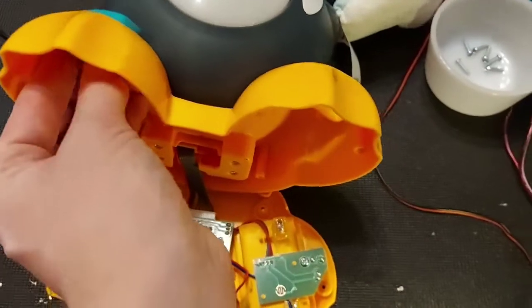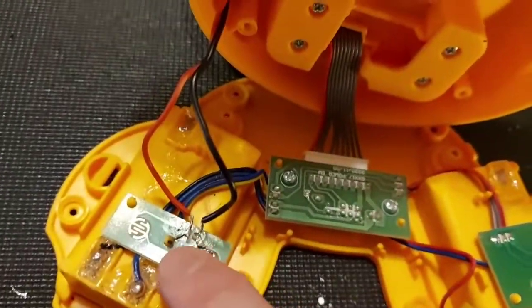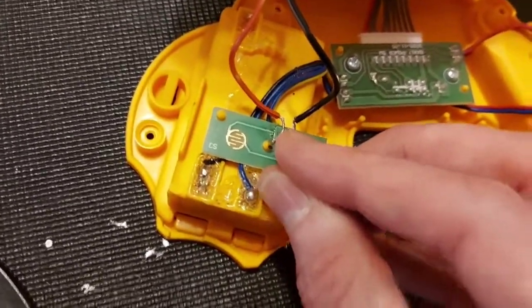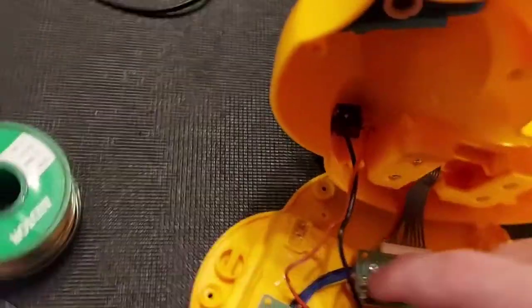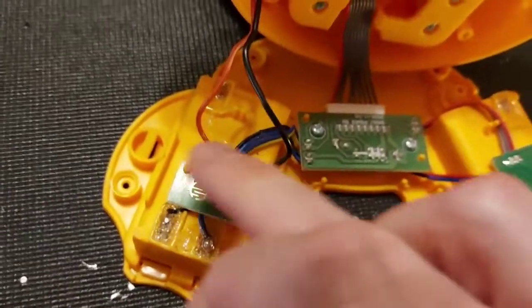You put your pieces back in here with the buttons back in, put the feet back on, screw it all together and test it. I would suggest you test all the way through the process — try short-circuiting it at every possible place you're actually trying to connect. Take a screw before you solder and make sure that really is going to happen when you short-circuit those two points. Does it make the toy start? You can take those two wires and just touch them together once they've been soldered on, and you'll know everything is okay up until that point.